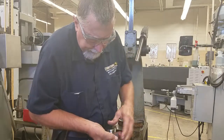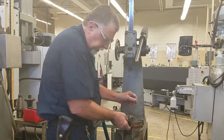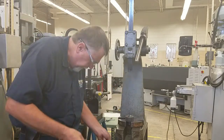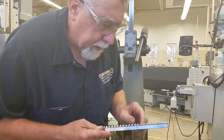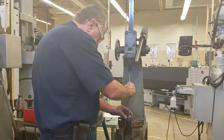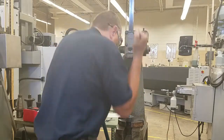So we put our guide back in and put our shim in it. And the shim is going to actually push the broach out just a little bit further. Okay, so here's our broach. You can see the teeth where they have cut. There's a little piece of metal right there. That's how much it's curled up, about 4 or 5 thousandths. So now we're going to take it through again, the same slot, and see what can happen with this.